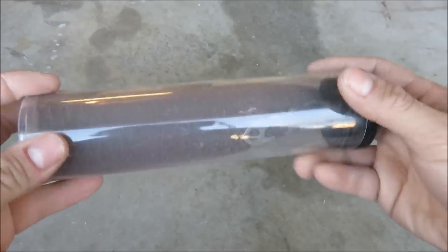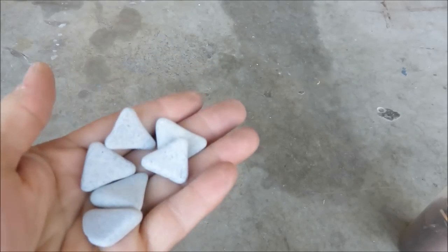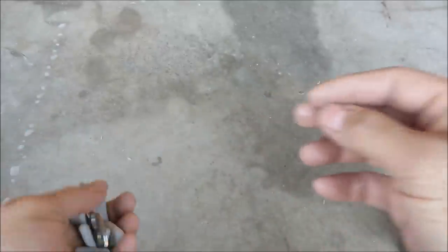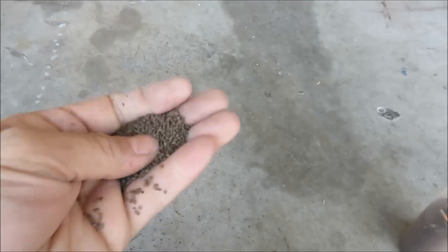The Diesel Junior will go into a drum filled with tumbling media, and it'll rotate and tumble them around over the course of several hours to soften the finish. We'll be using different media — here's some ceramic media. The problem is it's not going to get in between the little curves very well while tumbling. So to help with that, we have this garnet, which will be tumbled in with the ceramic media. And then finally, after that's all cleaned up, I'll tumble it in this crushed walnut. There's a whole bunch of walnut shells.